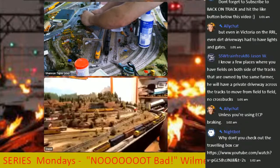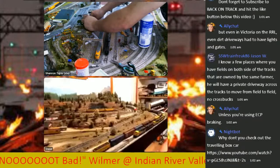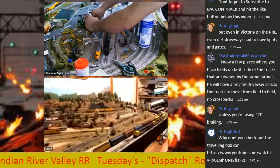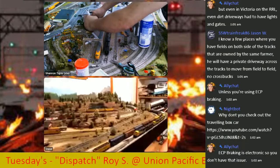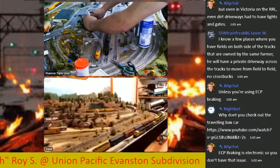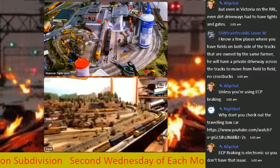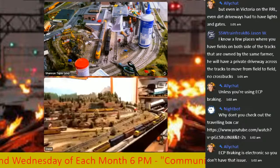So what DPU has done is, by putting power on the rear end of the train, the railroads have found out that you can charge the train line much quicker with compressors on both ends of the train, which makes it really good for running the train, because your brakes will release quicker and they'll set up quicker. And my understanding is that it's very efficient as far as guys working the head end. The trains handle a lot better.